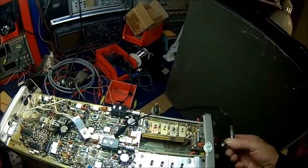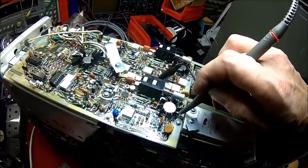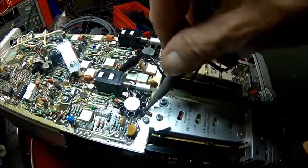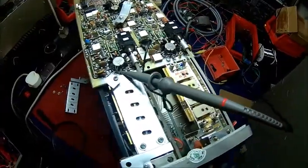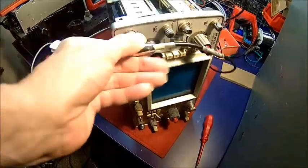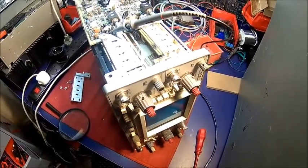Let's try the second channel — see if we get something out of here. But that resistor is a little bit... it probably needs work, because that resistor has been treated badly here. There we go — that seems to work. So the attenuator is working, which is good. The whole purpose of this action was finding out if the damage to the knobs caused any issues with the attenuator — but apparently not, at least as far as I can see. So that's at least something.